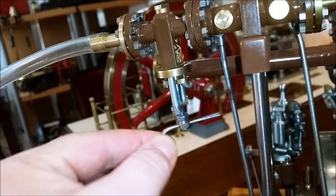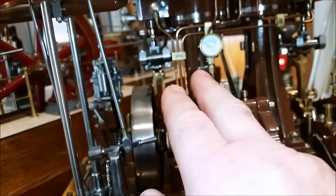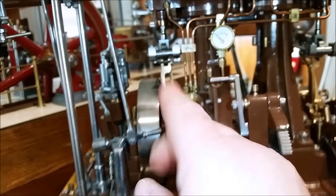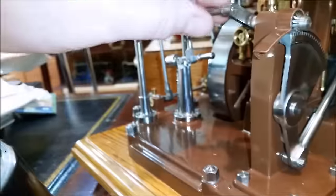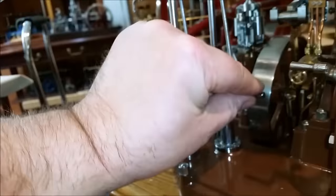The engineer would stand in this area. He's got an overhead throttle for the main steam feed, and here's a hand throttle that works very quickly. He needed to be able to act quickly to reverse this thing — probably under 30 seconds he could shut the mill right down and reverse it, as you can see on that quadrant right there, then turn it back on.